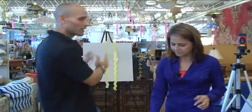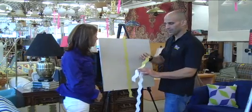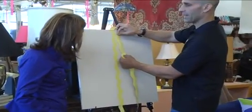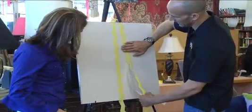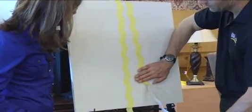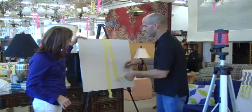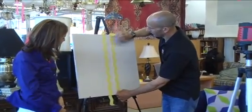I'm going to show you some cool designs and quickly show you how you can put it on a wall. This is the chevron design — it has a little paper backing on it. Just get it started, and depending on how you space it, you can have a skinny chevron or a wide chevron. Put it on there and slowly peel the back side, running your hand along the edge. If you have a big wall and want a perfectly straight line, just put your laser level on there and run the edge of the tape right along the laser.